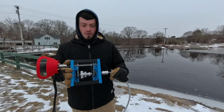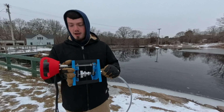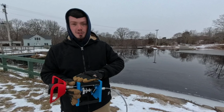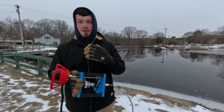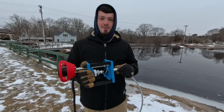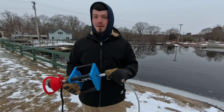So let's start on the 30 to 20 tooth, the 1.5 ratio, and see what kind of output we can get. This is a little different from our last one because we have a new motor, and we will also be able to change our ratio. But I think this is our best chance of making good power output. On the bench, the 36 tooth pulley was able to make, I think, about 60 watts of power, which if we can do that here, will be a new record. So stay tuned and let's see if we can break a record.